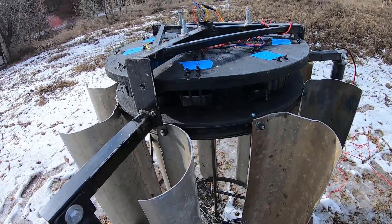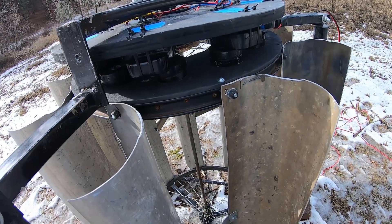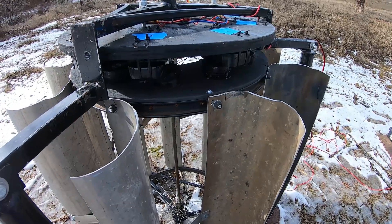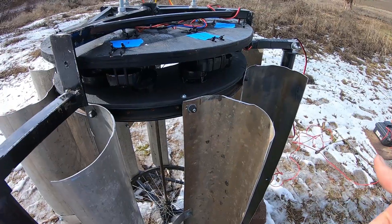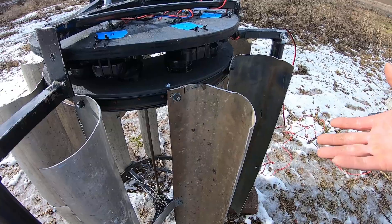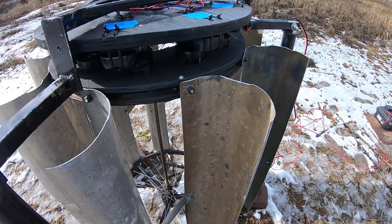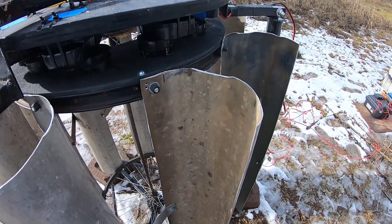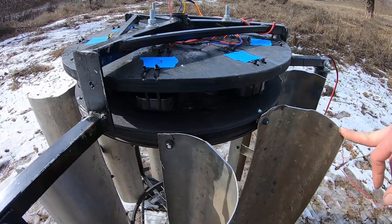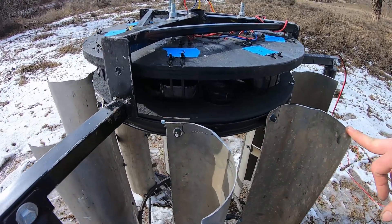The reason why I went with the secondary coils is because you have more turns of thinner wire, meaning you'll generate a higher voltage, because the length of the conductor will directly affect the amount of electricity you're producing. Back to those three important factors in power generation: it's basically length of conductor, force or speed of motion, and the strength of the magnetic field that you're passing through the coils. The longer, thinner windings generate a higher voltage, but are capable of less current flowing through them. It's a trade-off, but this isn't going to produce enough where it'll be a problem.